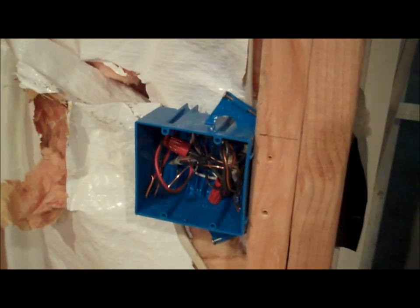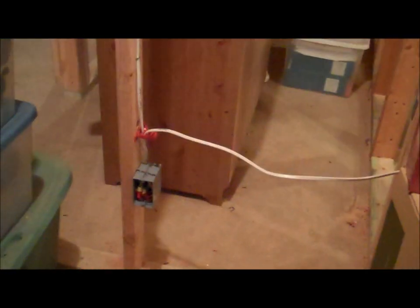This is going to be a little walk-in closet area under the stairs. There's actually going to be a pull-chain light in here — the switch just wasn't working because there's a steel beam making it complicated. There are some outlets that'll be in the living room, and more outlets in there. There are some switches here: a switch, outlet, switch, and an outside light. On this side there's a switched fan that'll go on eventually, and recessed lights. In the bedroom there are outlets, a switch that'll control the light. This will be a GFI outlet — anything near water should have GFI.